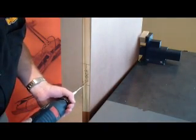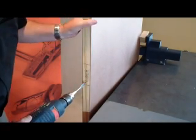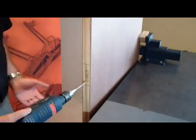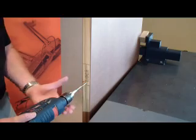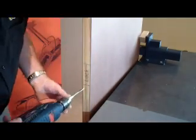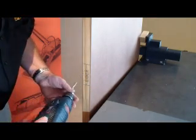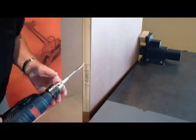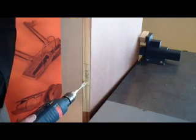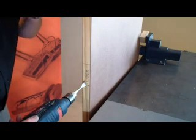When drilling, one needs to be careful to drill straight. When drilling, one needs to ensure one drills straight into the timber, that the drill is in fact on a level plane horizontally and also a level plane going into the timber. If we drilled at an angle like this, the bit would pop out the door that side, obviously at an angle like that, or up or down would be creating an aperture much larger than the one we would like to have. Always be sure to wear the correct protective gear for the power tools being used.